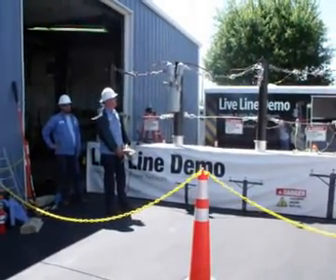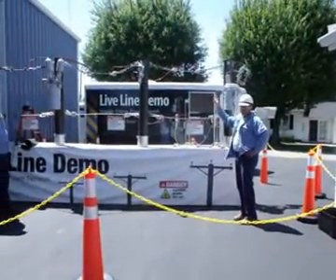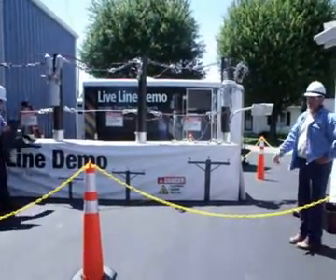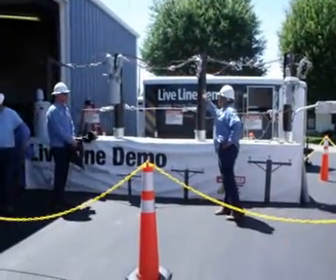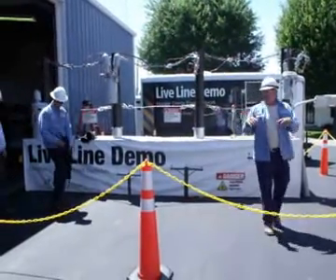Our little tabletop's not very much loaded. That was actually 7,200 — closer than you'll ever want to get. Hopefully. Breakers — we have bypass switches. You hear us changing breakers out. We just did that yesterday. We switch in behind, close it in, take the breaker offline, then reverse everything and put it back on the line.